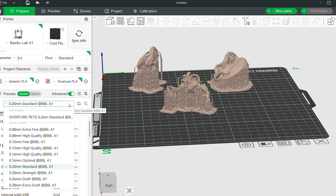Layer height equals detail — layer height is where the magic happens. For miniatures, you want to live between 0.08 millimeters and 0.12 millimeters. That's what's going to make your miniatures look smooth instead of like they all have scales for skin. If you're not sure, remember this one rule: your layer height should be between 25 and 50 percent of your nozzle size. Any smaller, and you'll probably be printing to the next ice age.